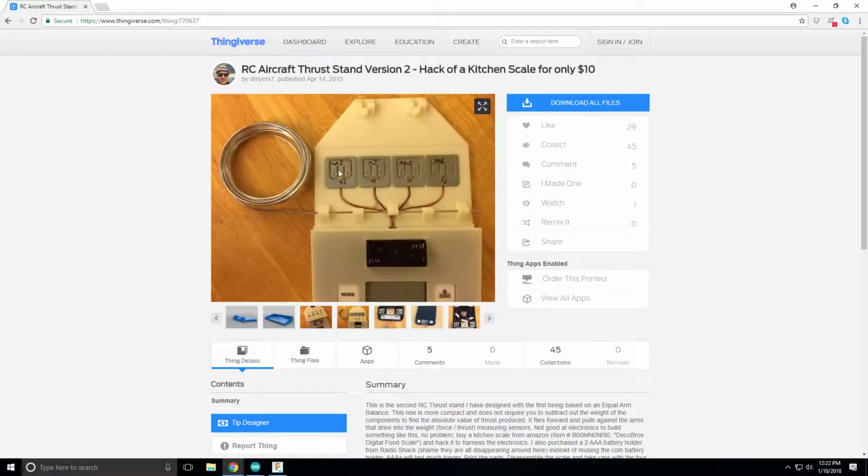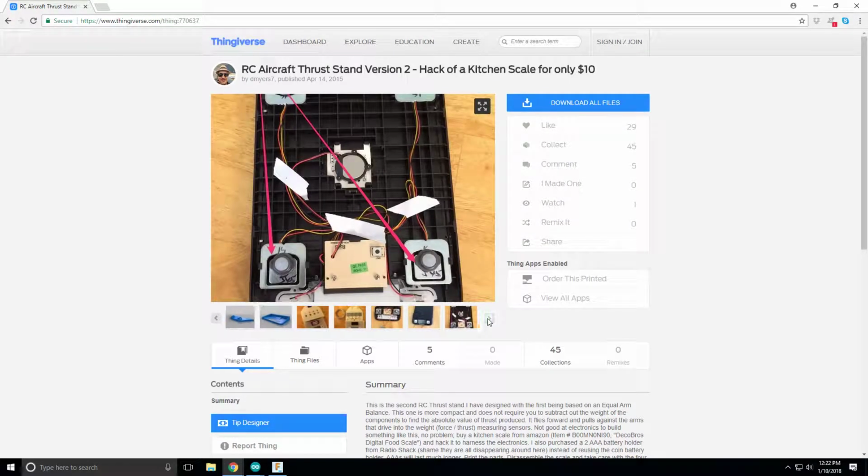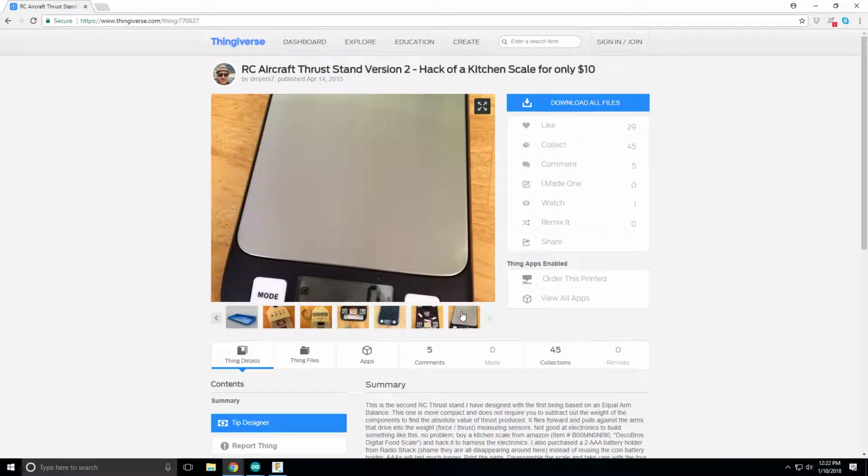From this picture, you can see that it's pretty weak here because they want to see drastic changes. That way they can do fine measurements. Because if it was really thick here and it would barely bend, you would need to apply a lot of force. That's why a lot of load cells will have a rating on them. They'll say 500 grams or 1 kilogram or whatever.